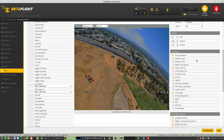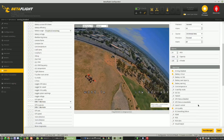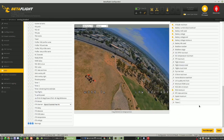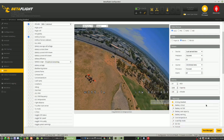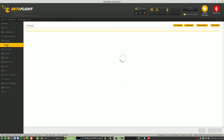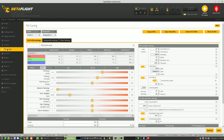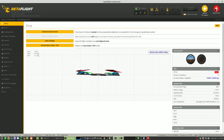I spotted right at the bottom that the three columns still have three ticks, so I'll go back and get rid of the extra ticks on the other two profiles since I'm not using them. With that all done, you can see where things are going to be displayed on screen — the warnings and the altitude. I'll save those settings to the flight controller. Before I go, I have a quick look at the presets — I find these three great for my style of flying, and I'll modify the tune a little bit to make it less wild. Then I disconnect from Betaflight and I'm ready for a test flight.